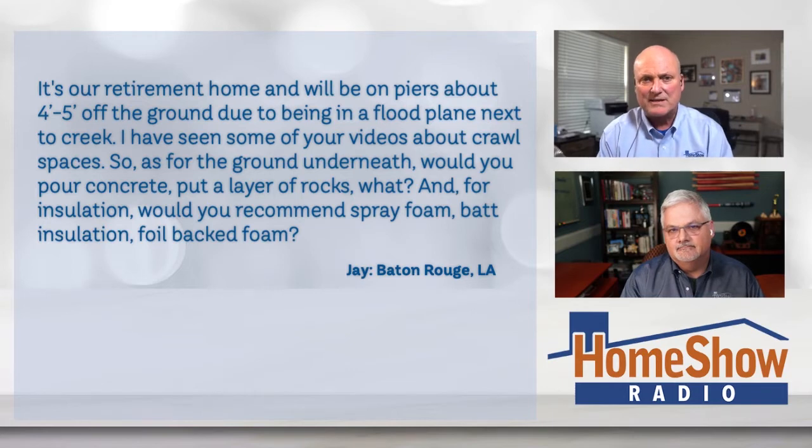Charlie, two things about this, and one he probably won't do — but I would consider the fact that if you're going five feet in the air, adding three more feet of height is not going to cost much, and then you can use it as a garage, storage space, put lawnmowers and stuff down there. That would be my first suggestion. I built a home in a flood plain once, it went almost five feet tall, and when the owner finally got to crawl under there, he said, 'Tom, I wish we had gone higher.' He had this door you'd have to get real low under, banging your head, getting lawnmowers in there — he always regretted not going those few extra feet.